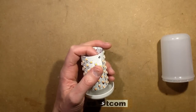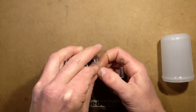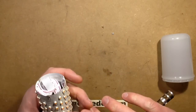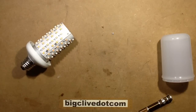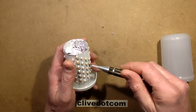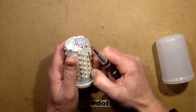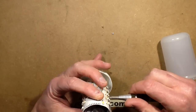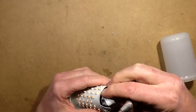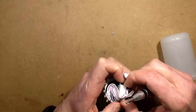Fumbles for a fine screwdriver. Let's undo this little nut and bolt first. I'm guessing the reason for the nut and bolt at the end is simply because the aluminium core doesn't go up that high. The bulk of the heat in use, certainly in animation mode, will be at the base — but having said that, it's not terribly high power. I'm going to try not to break this because it's kind of nice and I kind of want to keep it. So I'm going to try and lift this up carefully. I'm a bit cautious about accidentally pulling these cables off the circuit. Initially there's a plug — one connector is slightly bigger than the other, so effectively they are keyed.